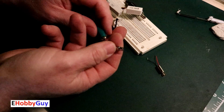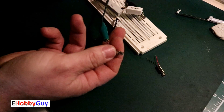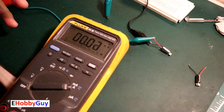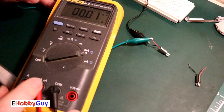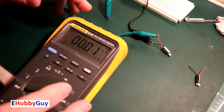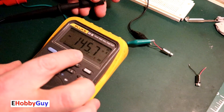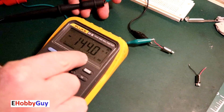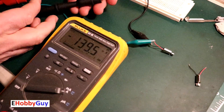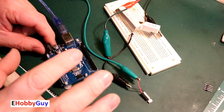I think I'll get an Arduino, an LED, and a transistor and have the Arduino switch this on and off intermittently. But first, I was curious about how much current this little motor takes, so I hooked up my meter on the milliamp setting. There it goes — 140 to 145 milliamps. So we're looking at 1.5 volts, about 140 to 145 milliamps — handy to know when designing anything.